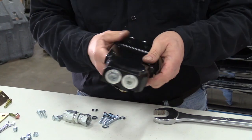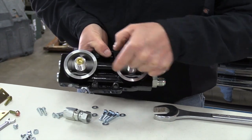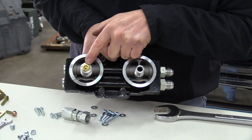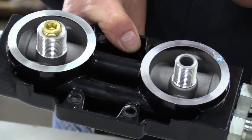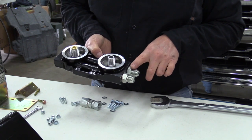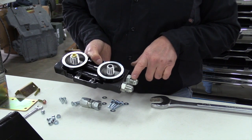I want to show you the filter head. This shows the direction of flow for the oil — this is the dirty oil coming from the engine, and it feeds in on the outside of both those filters. It goes through the pleats from the outside up through the center. The full flow filter will be right here; this here is your bypass filter, and you can see there's a restricted orifice in the head. That's designed to flow about a gallon a minute on the bypass filter. The oils both join up together once they go through the filters and then get fed back to the engine. It's very important — on the clean side especially — keep the hoses and all these fittings clean, because on the return side, once you're headed back to that engine, the next stop is the engine bearings.